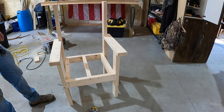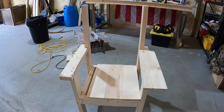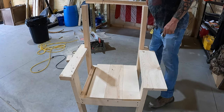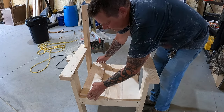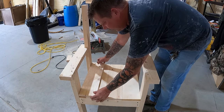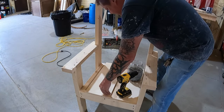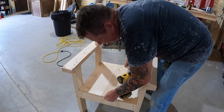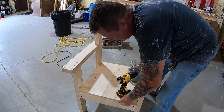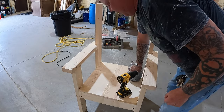There it is without the seat and the back rest. I'll cut those pieces real quick and throw those on. I got my three at 21 inches on there, and for the last one there's going to be a void on the side, so I put my mark right there and rip it on the table saw. Make sure everything is nice and flush up to the front — the front is the most important. Then we can start zipping them up, and I'm going to move to a smaller screw since I'm going through a lot skinnier of material.